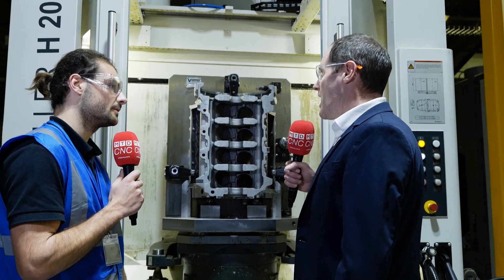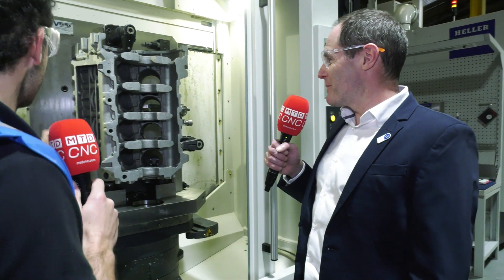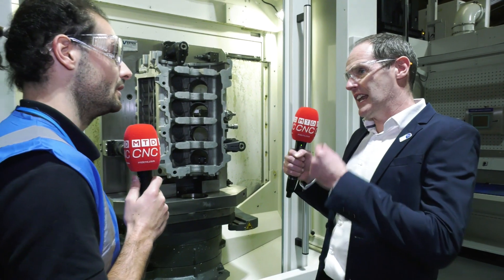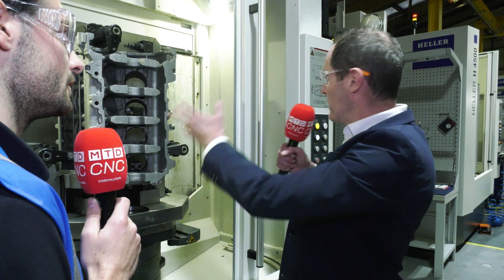So how do you eliminate that twisting? One, experience. Two, through the design. You want to make sure that you're clamping down where you're supporting. Alignment of the clamping points and the seating are absolutely critical, because at this stage if we're introducing even 0.1mm of error on the flatness across the whole of that face, then further down the line that's going to become an issue.